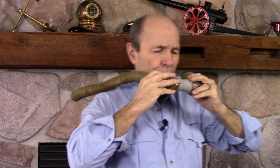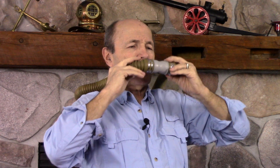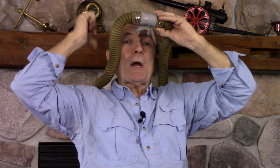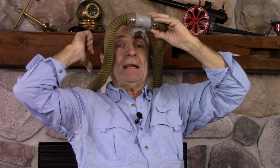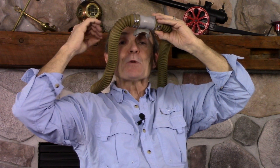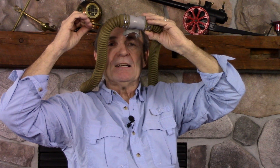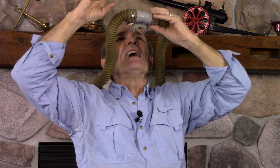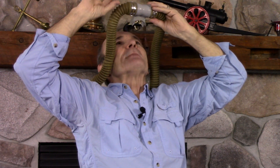There's another trick — because the mechanism is mounted back between your shoulder blades, lower than your mouth. If you took the hose on a two-hose regulator and lifted it up above your head, it would start to free-flow — bubbles coming out — because the mechanism is under greater pressure, being deeper in the water. You let it free-flow to push the water out, then slowly bring the mouthpiece back down. That first breath might be a little wet, but mostly air.